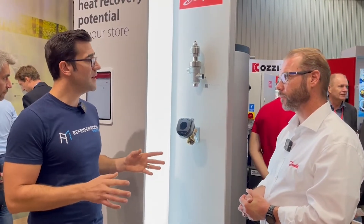Correct, yeah — it is a stepper valve, so it has the same type of motor you have on the CCM. It looks similar, not the same, but similar. And what I really like about the Danfoss is that you can take them apart. If you run into an issue, if you get dirt in them — which there shouldn't be any dirt because you're supposed to clean and evacuate the systems really well — but you can take them apart if needed. The CCMT you can take apart; the CCM, not so much, but the CCMT you can.